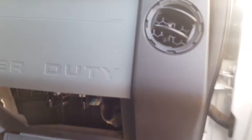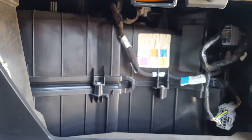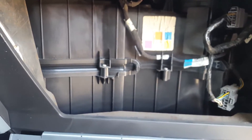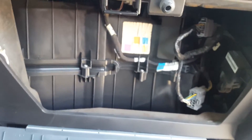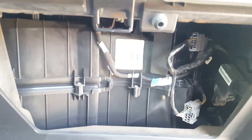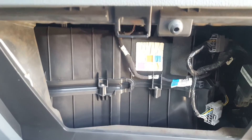The downside is the evap connector is right there, but in order to replace that sensor you have to remove the entire dash and then disassemble the AC box. The book time on this is about 10 hours. There are a lot of people that might not be able to afford that, and it is starting to warm up, so here's a little tidbit.